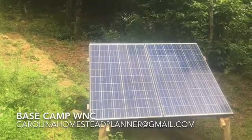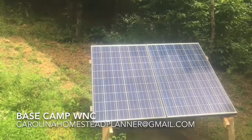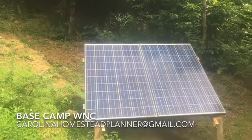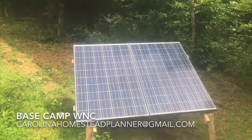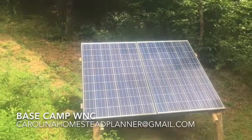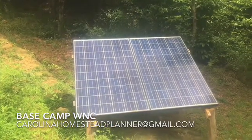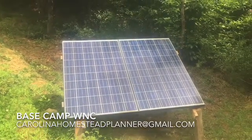I've helped a lot of people, and a lot of people wish they were told this before: a DC-powered pump just doesn't act like a surface pump. It doesn't crank back up under pressure and maintain pressure. There are some companies out there selling stuff, but it really just doesn't deal as well. Now, this system can be done with a solar-powered pump. You could also do this with a regular grid-powered pump, and I'm going to do a different video on that and some benefits with it.